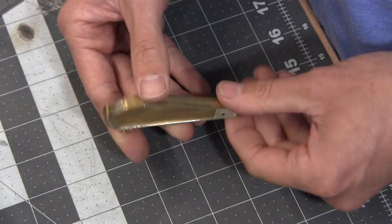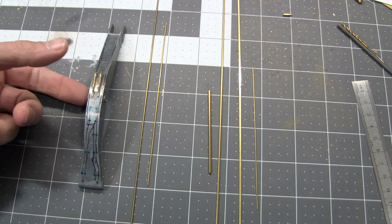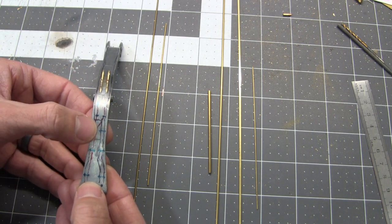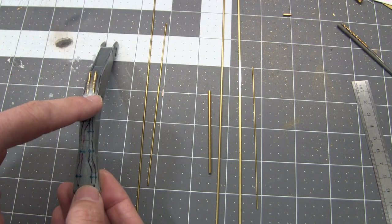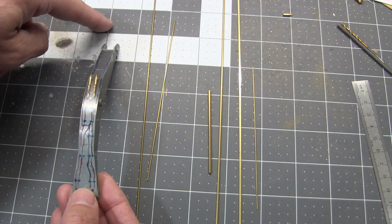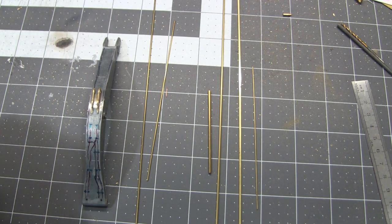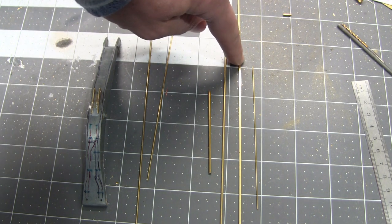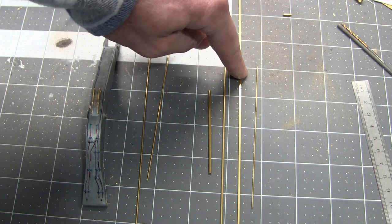You can see here we've got some scribbling going on on the back of here. I took a couple pens and marked out where all the lines need to run. We have a series of lines on this side that are a little bit thicker — for those I'll be using 1.1 millimeter brass — and then some lines here that are a little bit thinner, using 1-mil brass. These are the lines that run down the boom to the bucket cylinder. There are also little brackets that hold all those lines in place — I'm going to be making those using 2-mil tubing, 1.5-mil tubing, and then some brass, mounted with rod. But first, we need to put holes in this for the rod.